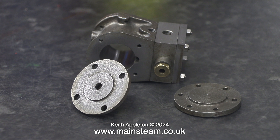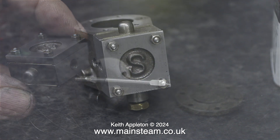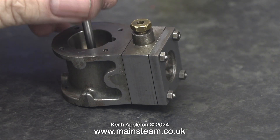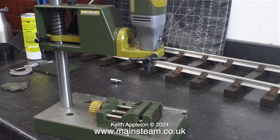The only part of these covers that needs cleaning is the outer part of the top cylinder cover. This is a bit of a problem — the exhaust hole's in the wrong place, and it's too close to the inlet. The small hole for the exhaust is 2BA, or so my calibrated eye told me. I verified this by screwing in a 2BA tap, which went in without any friction whatsoever. I'll leave the steam chest this way around for the time being, but I'm really hoping I'll be able to successfully reverse it. After the wet stone treatment, you can clearly see how much better the front surface of the steam chest cover looks. The cylinder bore is very clean and well machined. This engine has done a bit of running in its time because the piston is worn, but that's not a bad thing. I'm going to fit a silicone O-ring to the piston — you need the piston not to be a tight fit in the bore, so the oil can get through to the O-ring. More about this in a future episode.